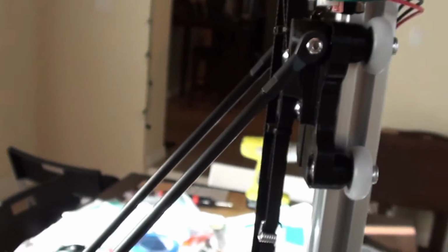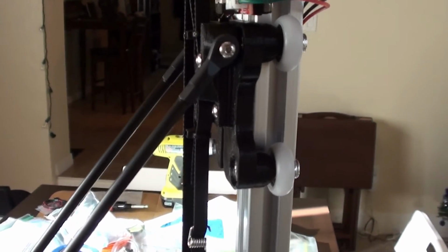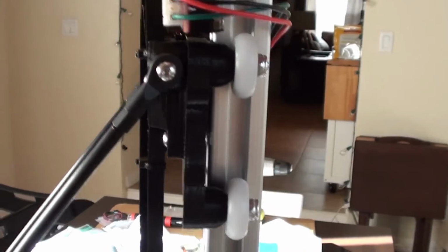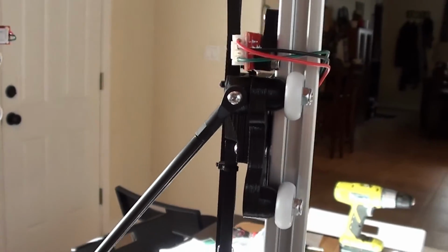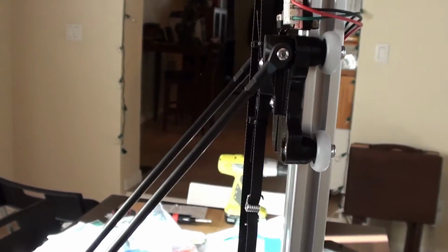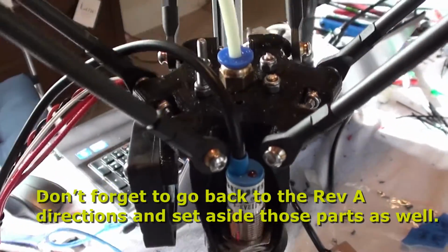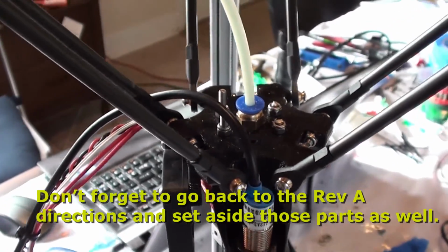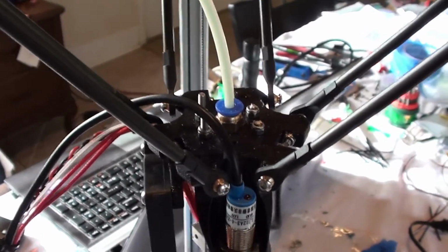Now, I didn't know at the time I was going to have a pile of leftover parts, so knowing that, what I would tell you is this, very helpful hint. Go through your instructions. Put aside all the parts that you will need for each individual step and see what you have left over at the end. That will let you know if you can use the shorter screws and different locking nuts or other parts, so that you know you have that kind of backup there. And you won't have to do what I do, which was hours of sanding, filing, and otherwise adjustment for the screw size.